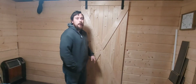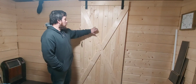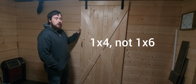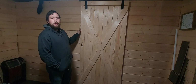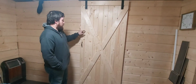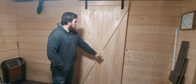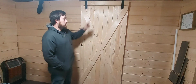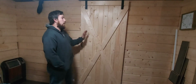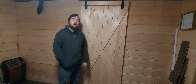So here you go. This is 13 pieces of 1x6. It's 1 inch, and it's finished, so it's slightly less than 1 inch, closer to 3/4 inch thickness, but it's 1x4. So it's 13 of these between all of these here, one here, and then this one can be divided for the bottom. And if you're going to go ahead and make an outside border, you're going to need 2 extra. So I would call a finished door around 15 pieces of lumber.